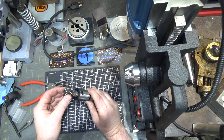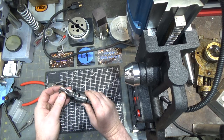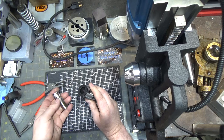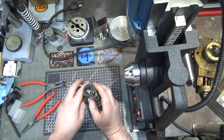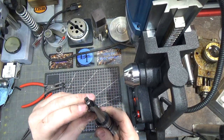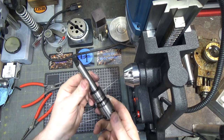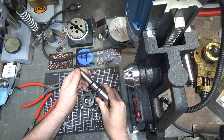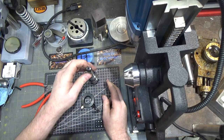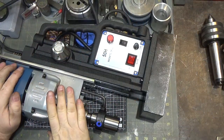You can see how sloppy this is — that's a couple thousandths of slop right there. On top of that, when you tighten it down, the screws are below the support point, so it's going to cant the cutter slightly, which is probably why the runout is so bad. And apparently this is not hardened either — the Morse taper removal tool completely flattened and dented the bottom of the Morse taper. It's not even hardened — that's really sad.